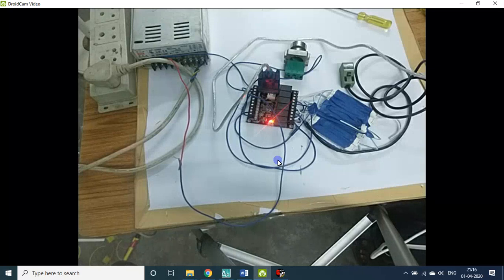Whereas in the case of Arduino, it is damn cheap, no doubt about it. It has many digital inputs and outputs and analog inputs. 10 bit ADC is there on 6 or 8 analog inputs. But if there is any leakage current, it takes the signal unwantedly, even before pressing the button. But by shielding you can avoid all those things.